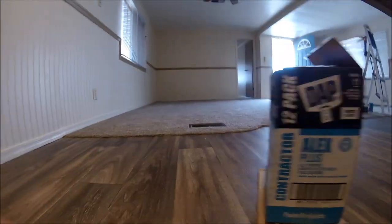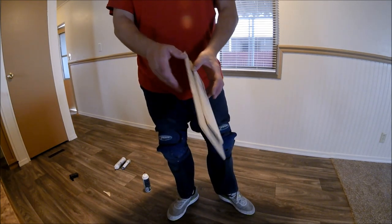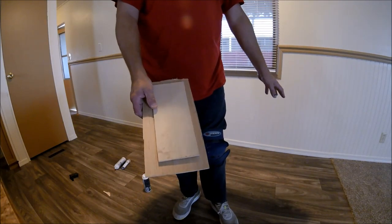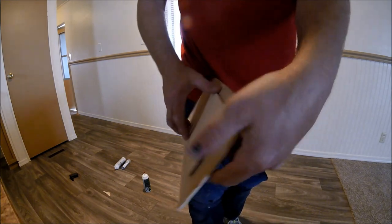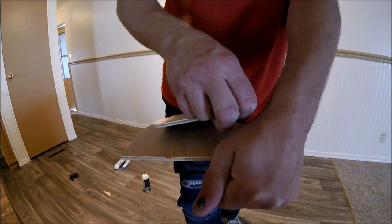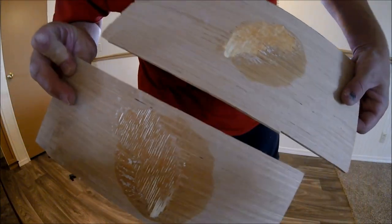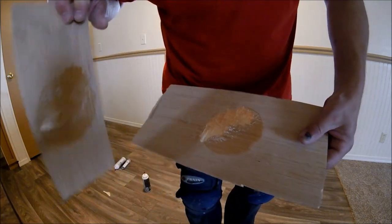That's how you take care of a bubble. These two boards I put the sealer on a while ago just for the demonstration — to show how far one little drop would go. I was using them, just kept them together to contain the mess, and set weights on them to put on the bubble. Just to show the power of that seam sealer — I want you to watch me pulling them apart. Listen — look at that! It actually tore the top layer of the underlayment off. That's how good that stuff works.